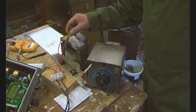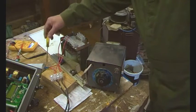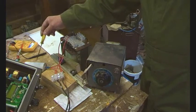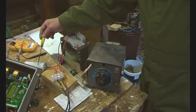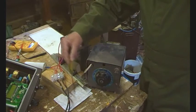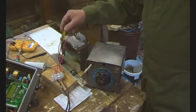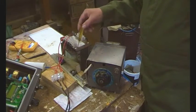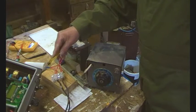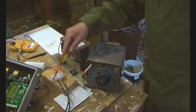The output of the 0 to 380 volt side goes to this rectifier, which is suitable for voltages up to 400 volts — that's fine. Then the positive and negative out of there go along to this block, and just here that is a 60 microfarad non-polarizing — i.e. AC but non-polarizing — capacitor that smooths everything out. The positive and negative output go straight to the grid tie inverter, giving us a mains-derived DC supply isolated through the isolation transformer and rectifier.